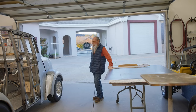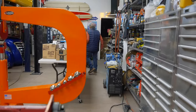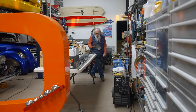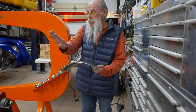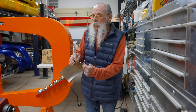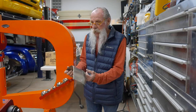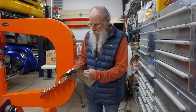I've got a sample here of something I started. You take a piece of black sheet metal — this isn't a great example, but it illustrates the point. You take a flat piece of sheet metal and put your curve in it. Then in this case it's got a stamped shell with a lip for the other piece to come down on. Once you get this shape — in this case with 20 gauge — you can go and make it a little tighter with your hands. But then when it comes to rolling this edge, to get that to roll without distorting it, you've got to pinch it or shrink it in the shrinker.